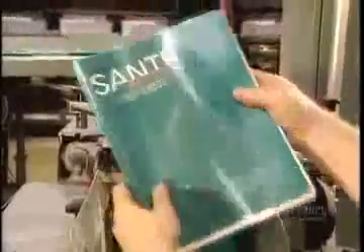By this stage of the process, with either binding method, most pages on the unbound sides of the book are still attached by folds. So to separate the pages, the books go through a machine called a three-knife trimmer, which cuts the folds off the three sides simultaneously. The book is now finished.